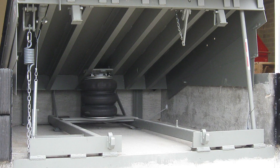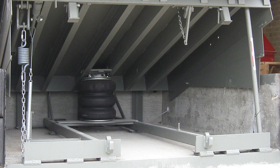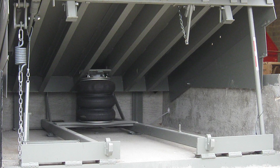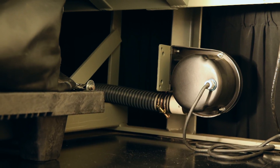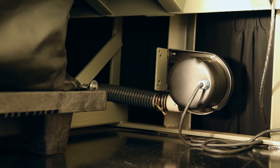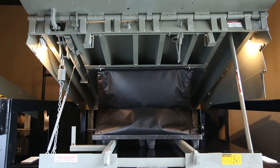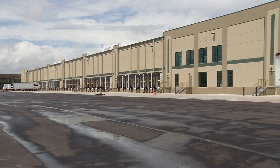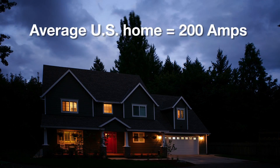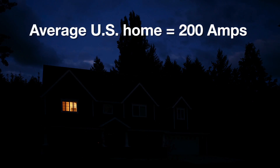When purchased with the lanyard or air push-button controls, the SentraAir leveler requires no electrical in the dock pits. Standard air dock levelers require an electrically-powered 11 to 15 amp blower motor for each dock in use, while SentraAir levelers require none. When compared with standard air-powered dock levelers, an install of 30 SentraAir levelers will reduce a building's electrical footprint by over 390 amps — the equivalent usage of two U.S. homes.